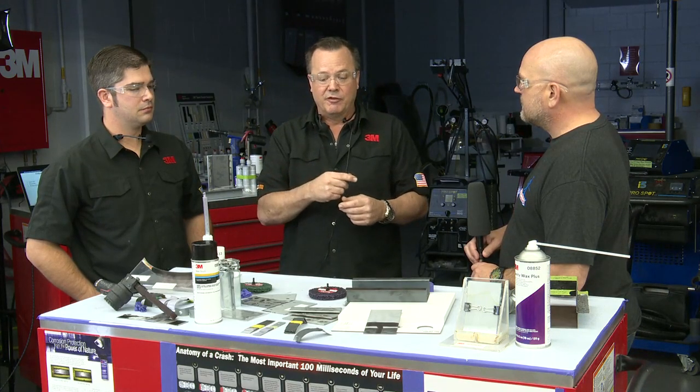The one thing you're going to notice when you're doing that is that just from the heat of the spot welder, it actually cures a little quicker. So you have to be prepared and make sure you get that panel on there in time, and just keep an eye on your work times and your cure times when you're doing it. But yeah, always through wet adhesive.